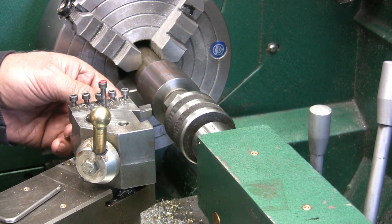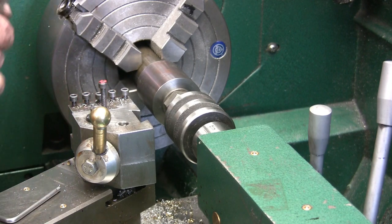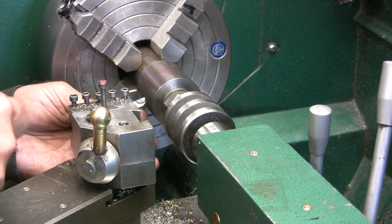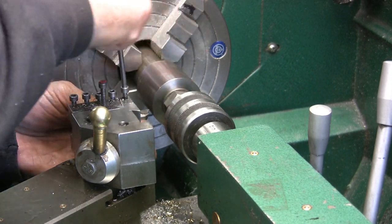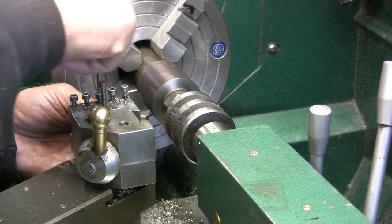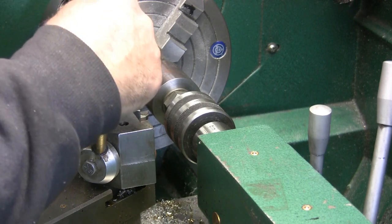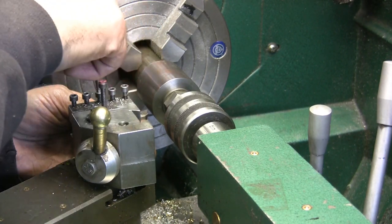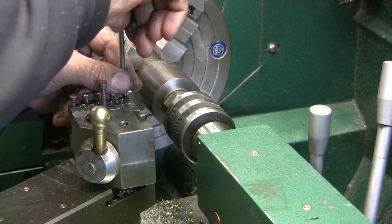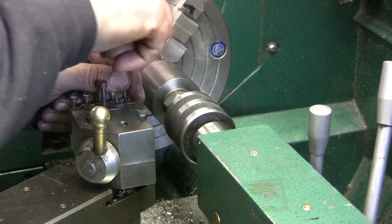I want to get the right tool bit for this. That one's chipped. I can quick sharpen it or find another one. Here we go, this one should work. We're going to leave a 250 shoulder out there, 250 or so, 200. After all, it's whatever I want it to be, I guess. I'll go back and correct my drawing if I change it on the fly.